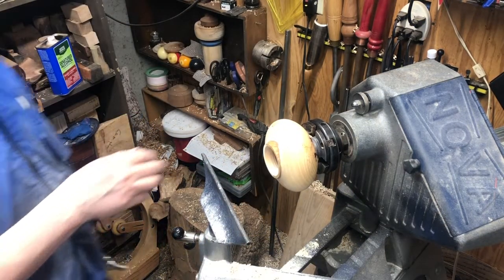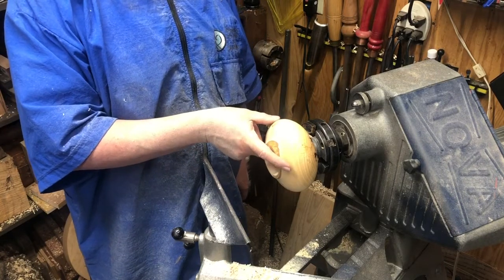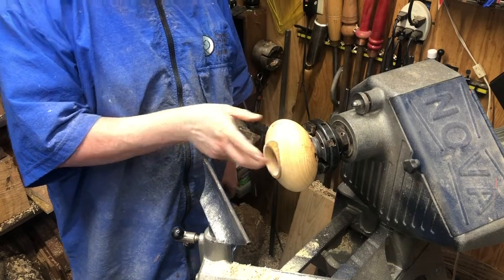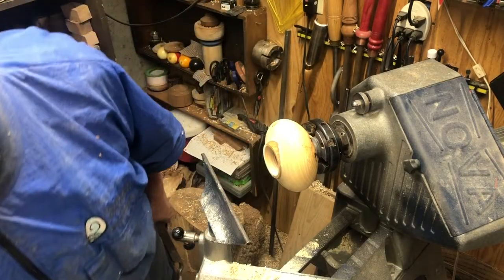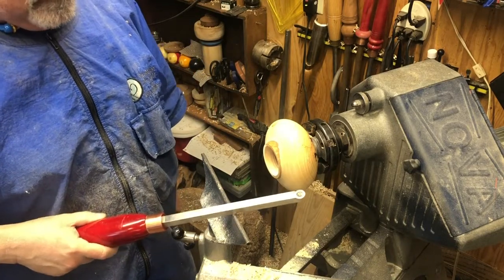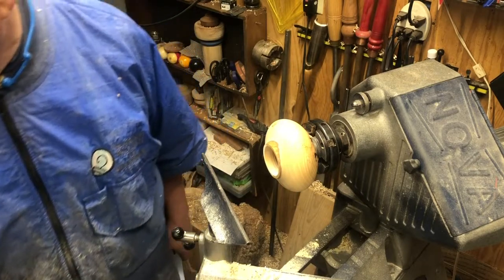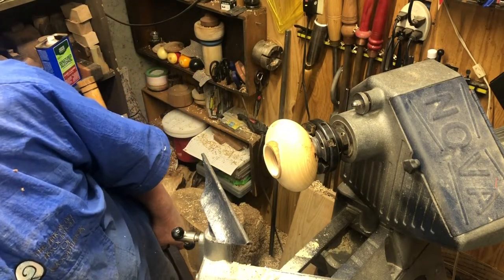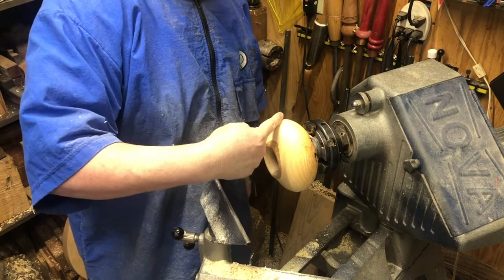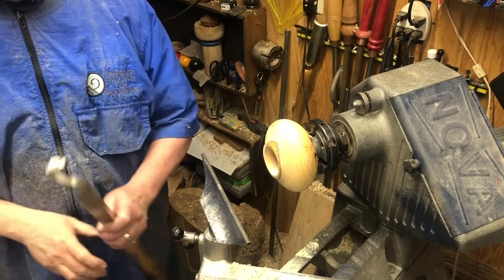I have got to say that the CI5, or the #1 hollower, is a great tool. It flat took the wood out. I've gone back with my CI0, the Easy Wood finisher, and smoothed out the bottom and started around the sides. But then there's a problem. You can only go at so much of an angle, and it leaves a good bit that you can't work on with a straight tool.